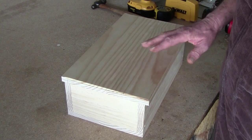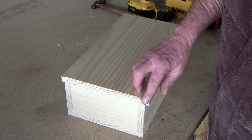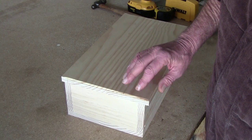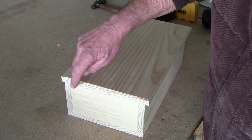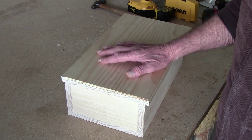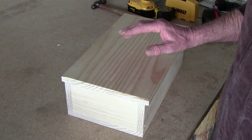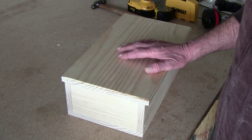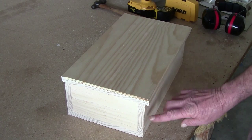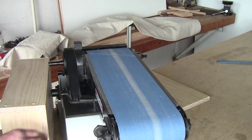Got a simple design - I'm not going to lower the bit for a fancier design because it's a simple box. You can see it's kind of burnt - that bit is not very sharp, which happens especially on end grain because it's so hard. Next step: take off the hinges, then go to the bench sander and put a 120, probably a 220, a 320 on it, then put it back together and put the plugs in.